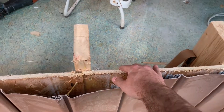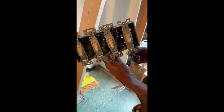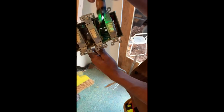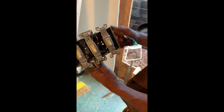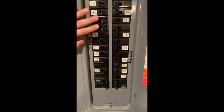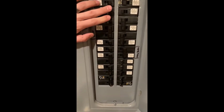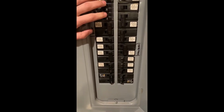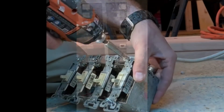away from your house. So we're going to go ahead and move the light switches that control all of the outside lights. There's still power to it, and my breaker box is not marked. So Carlos here is going to keep his tester inside here, and it's going to keep it testing until I shut off the breaker. All right, so we're guessing that it's these 2 here. Is it good? All right, we found it.